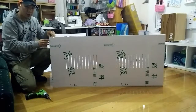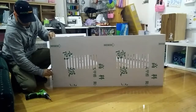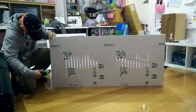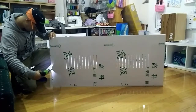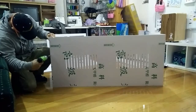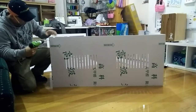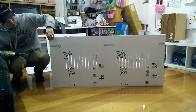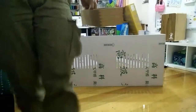Now, because this board is bowed, I've actually got this board pushed in on the inside, slanted in, to make sure that we get this side flush. And then you can pull it out as you work up. Back it off a bit, sorry. There we go. Beautiful. That's flush. Slowly pull it back up flush, like so. All you need to do is get the screw head to be a wee bit under the face of the board, and that is more than enough. So that's side done. How's the angle of the camera on that side? Beautiful.